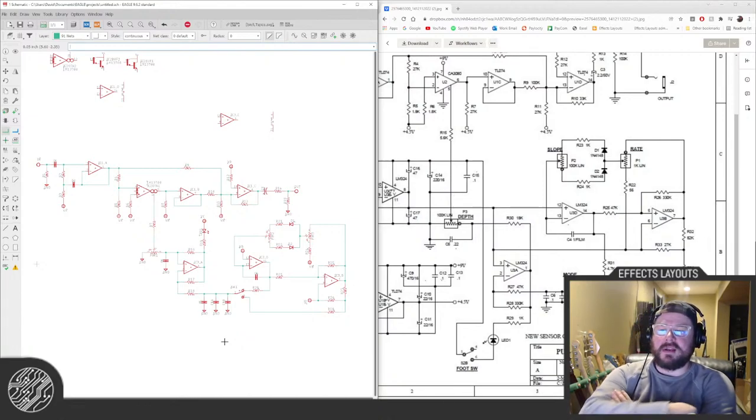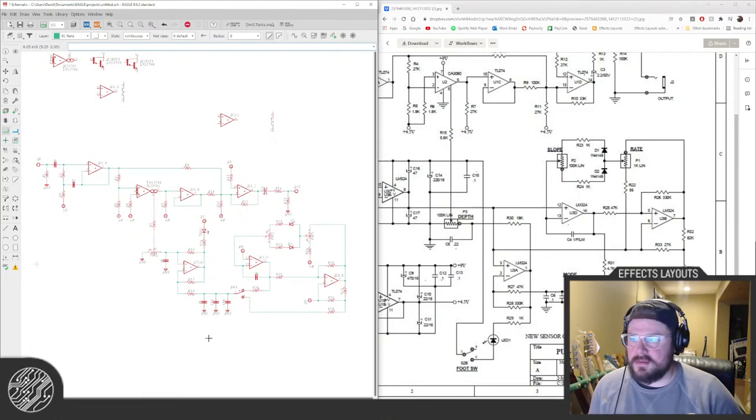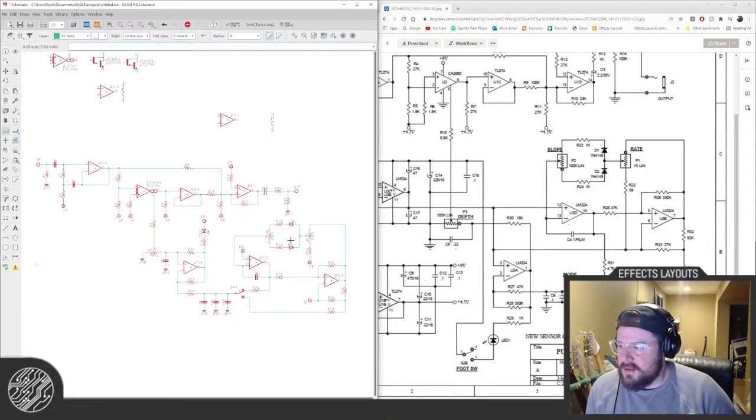The other option would be to go kind of crazy and have a second foot switch that triggers a different rate pot. So you could have, kind of like in Earthquaker's Palisades, where you have two different gain knobs and it's on a foot switch to go between the two. It'd be the same kind of idea, just with different speed controls. That could be cool. Then have a separate breakout board, but we'll probably just keep it simple to start with, and then we can do a modified crazy version down the road if we feel like it.